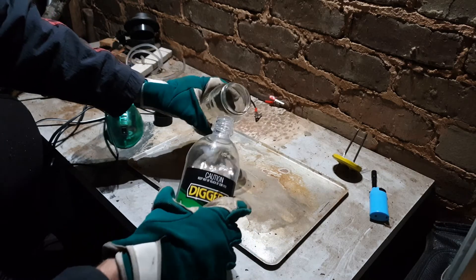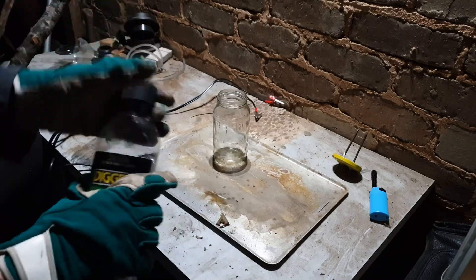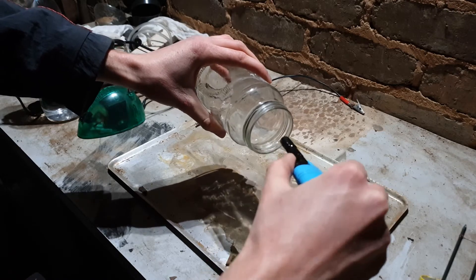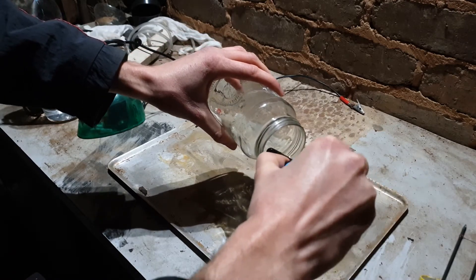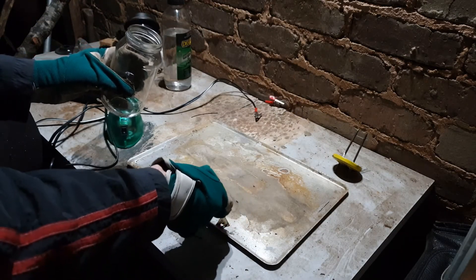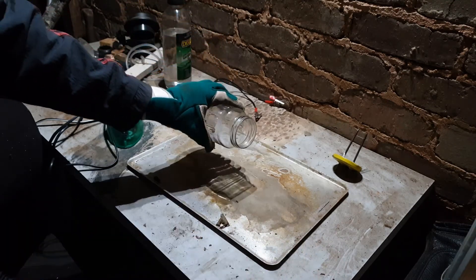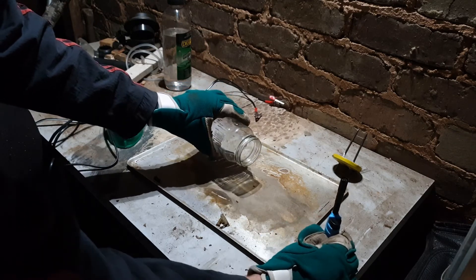I'll remove the oxygen just by burning methylated spirits in the jar and closing the lid. It's not a perfect solution as it doesn't only produce carbon dioxide but also water after burning, but it is still better than free oxygen. I have to get the ratio of alcohol to air just right, as I don't want alcohol heating up in the jar making a dangerous glass pressure vessel — I want it all gone after I close the lid.